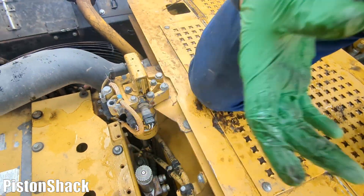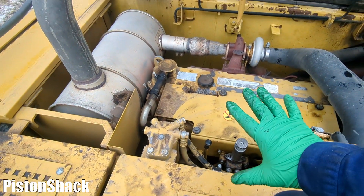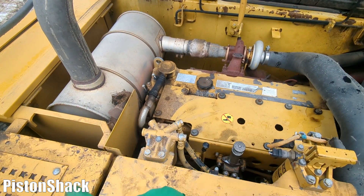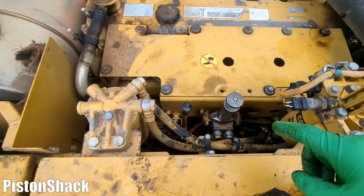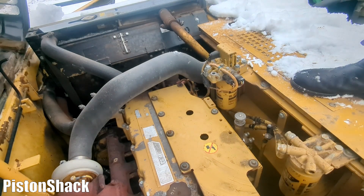You can see I'm turning the plunger rod and it's squirting fuel out — quite a bit of fuel already out. If you prime it before cranking, the engine will start much easier, but if the machine sits for more than three days it will take longer to prime the fuel up.